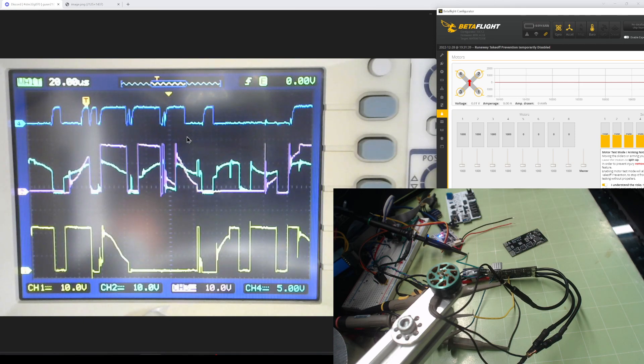In order to detect when it goes down, your interrupt will fire whenever this goes down, and then you check to see if the signal stays down for a period of time. That period of time is dynamic — it's dependent on how much voltage you're applying to your ESC board, because the higher the voltage the faster your motor will spin. Also the duty cycle, because the bigger the duty cycle the faster the motor will spin. So you have to keep adjusting over and over, depending on the duty cycle and the voltage. This is still pretty easy to check — there's one pulse, two pulses in the middle, so one pulse for every commutation event.